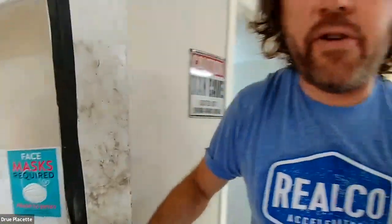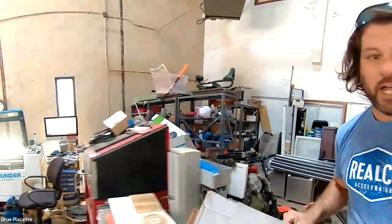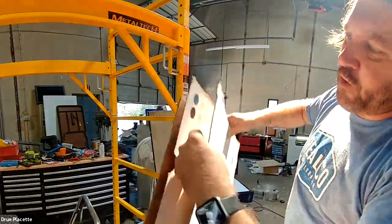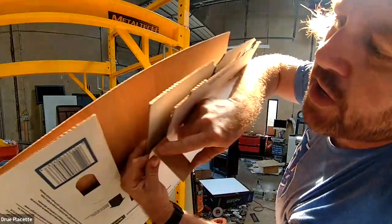If you get the laser module for cutting like that, a lot of times I'll just do custom boxes for shipping, and the laser module with the M2 is perfect for that. You can set something like 10% power if you want to do perforation, so it folds without breaking. You can do that perfectly.